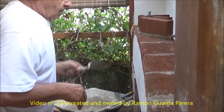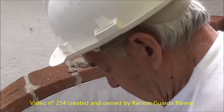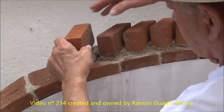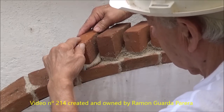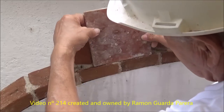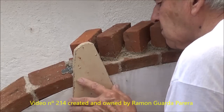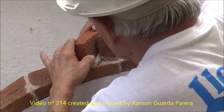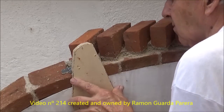It is advisable to always collect as much as possible of the material. Later we will fill in the joints above. It is entertaining to do, but once finished you will see an arch with a nice finish. We continue laying bricks, using spacers to follow the inclination of the arch. The tile gives us the brick inclination. By collecting the mortar you can appreciate if you are going well with the joints. If the joints were full you could not appreciate well if the width of the joints is maintained. The placement and depth of each brick must be verified with the template.